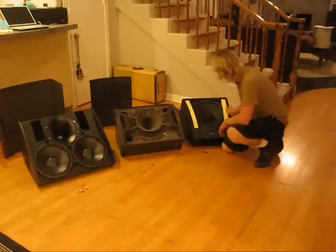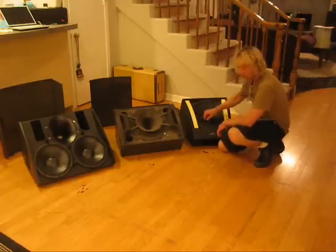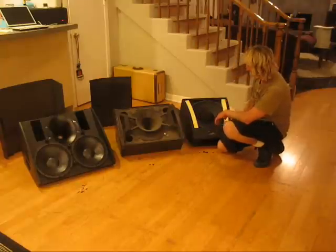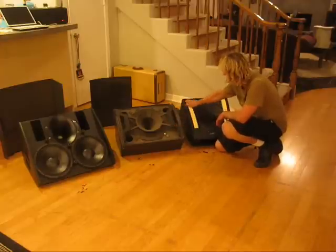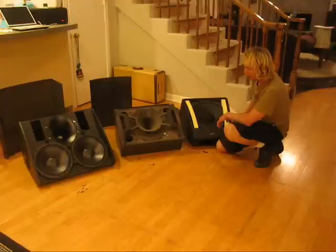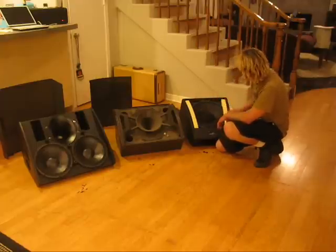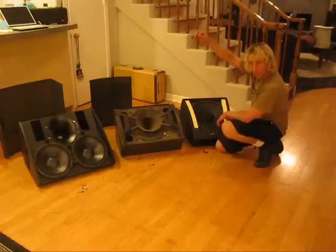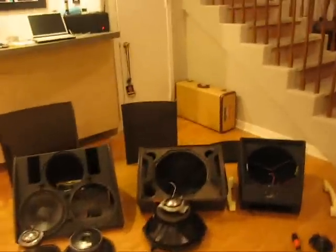And the Micro Wedge 15 has the coax with the dust cap covering — it's actually using the cone as the horn. On both the Allacoustics and the Micro Wedge you'll notice foam coming down the sides. While designing that, it was very interesting to see how much effect those slight little rails had upon the sound. The high end would hit that rail and cause a reflection, making it less stable feedback-wise — so these foam strips were actually quite critical.